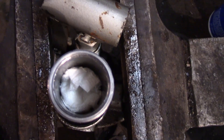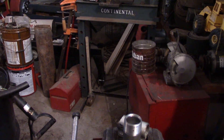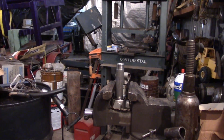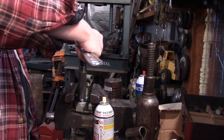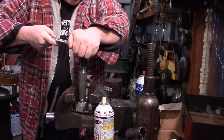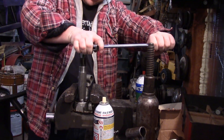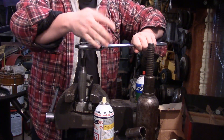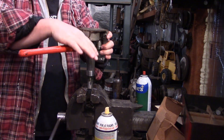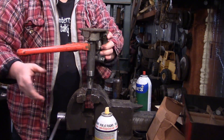I'm going to pipe tap this. I stuffed some paper towel in there so the metal shavings won't go in there. Once I get a good started thread, I'll take it out of the vise, flip it over, and thread it that way to further keep all those metal shavings out of there. How I've always started threading — I'll push down and turn, trying to hold this as stable as possible. Then I'll back-thread just a little, which breaks off that little curl, because in softer metals what happens is it'll actually start tearing your thread. Also, the reason I'm putting the pipe wrench up high is if I put it down near where I'm tapping, it'll actually squeeze the threads and cause an inaccurate thread and make your life a lot harder threading.